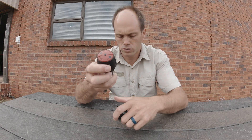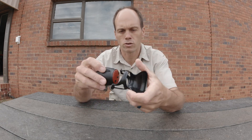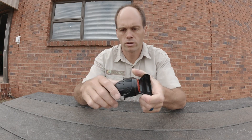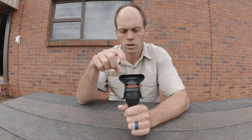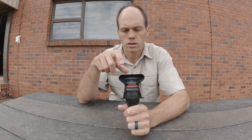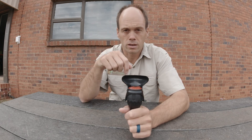I'll show you later how it runs and how it lifts. You get the road guard that you can use if it's sitting next to the road — you can channel that water back onto the crop or onto the field. It simply just pops on like that, easy. Just remember when you're putting this on, you're effectively putting double the water back onto the land or the crop, so you want to go half or 60% of the size that you're using on your 360 rotation.